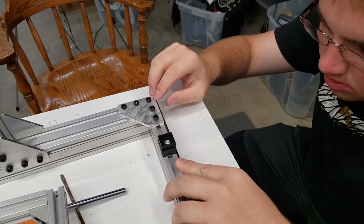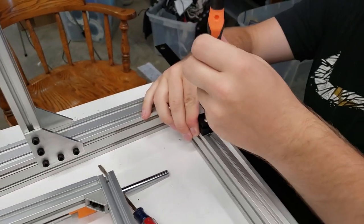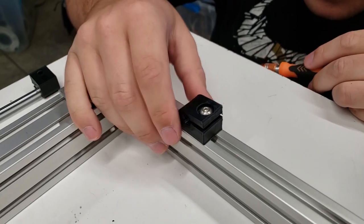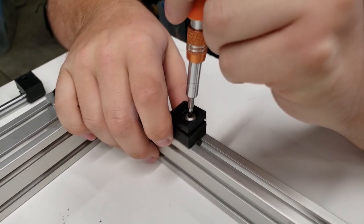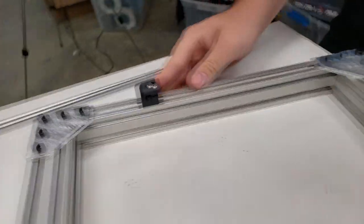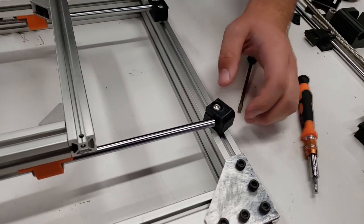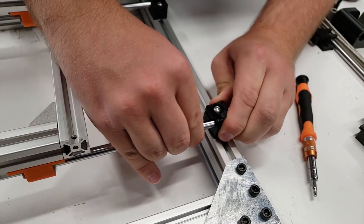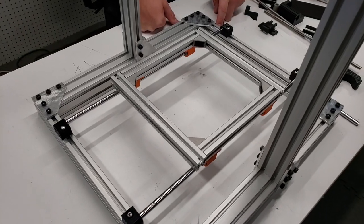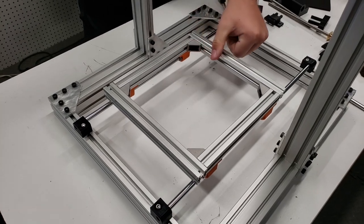Danny is measuring here. What we did was measure the center points of the bed where the rails fit through — center to center to where these brackets go, right to the 2040 extrusion. This doesn't have to be 100% precise because you'll need to tighten it up once the rails are in place, but you want to get pretty close to the permanent location. Do this on all four sides. Once the blocks are in place, just slide the rods into each one of the blocks. Note that this rod is a little short — the description has the proper 440 millimeter length. Once all rods are installed, give it a push and make sure it's sliding freely. And there's Danny giving it a thumbs up.